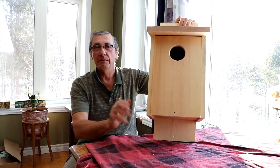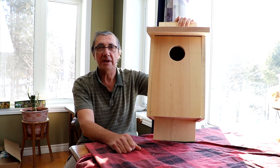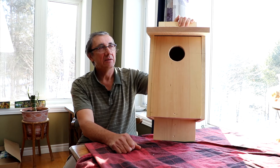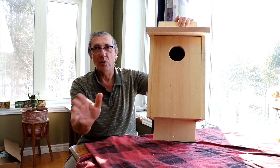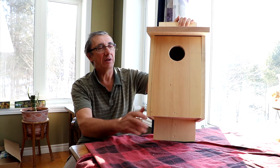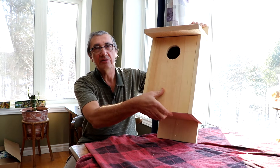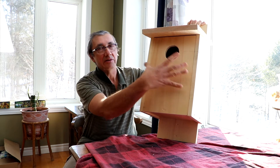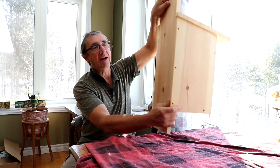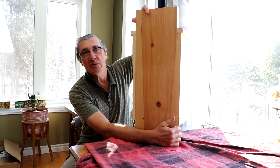The basic idea behind that general design is that you can do this box out of one piece of 1 by 10 by 8 foot long pine. So that's the nice thing — you just get one piece of that wood and you can build the whole box and have a little section left over. The only modification I made is instead of putting the front on top of the sides and the sides on top of the back, I've actually put the back and the front in between the sides.